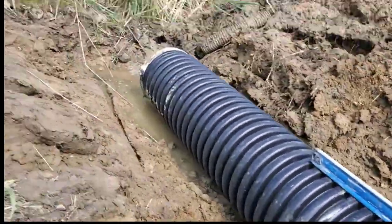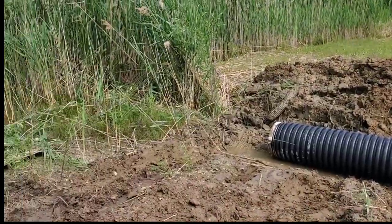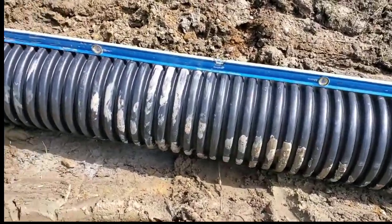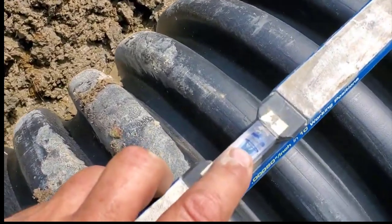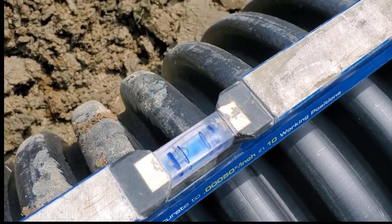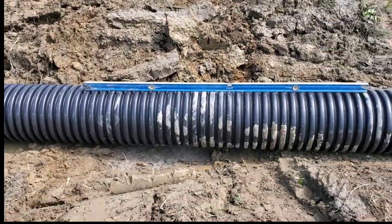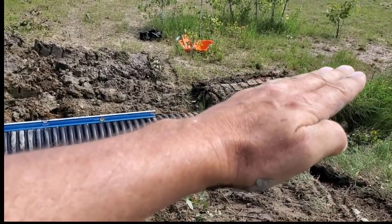This is a man-made recreational lake, and this is pretty much a stream and spring — in the fall it's always moving water a little bit. I dug down and got this pipe in about a third of the way — I just eyeball it but I've set many. The reason you want the bubble upstream is because if it's level, it's not going to flow water very well. And you can see right now we've got the bubble riding high upstream.